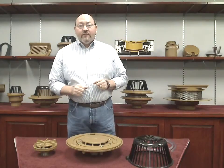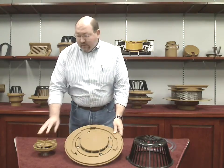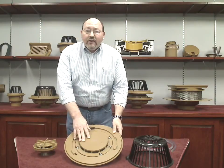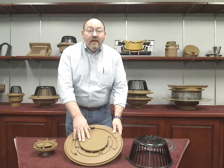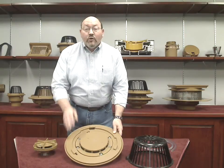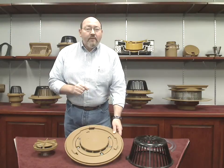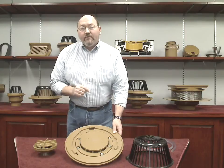The most noticeable difference is the air baffle. The Figure 1005 and 1605, with their unique air baffles, have been engineered and tested to inhibit the emission of air into the piping system, stop the vortex, and produce a more linear flow. This allows them, when used with a properly designed siphonic drainage system, to prime and sustain a full-bore siphonic flow during periods of heavy rainfall.